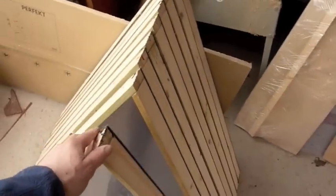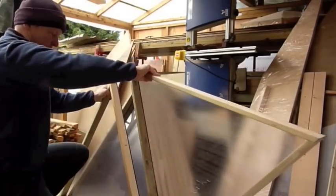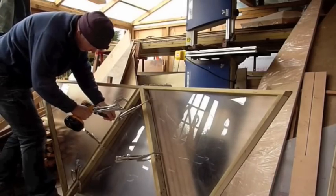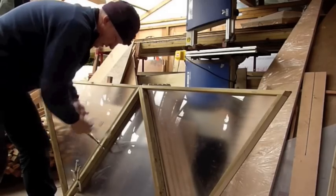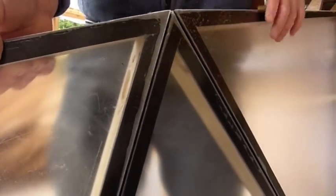We have our finished triangles stacked here. If you stack them, remember we had a little mark on the top — I've stacked them all that way up. What we need to do next is start pre-assembling them. Take a triangle and turn it like that so that the two top marks are together — forming a half hexagon. Because of the groove we cut, you can see that we now have a groove left to put the silicone sealant in.